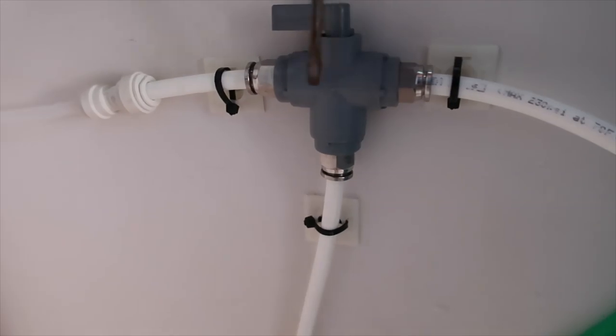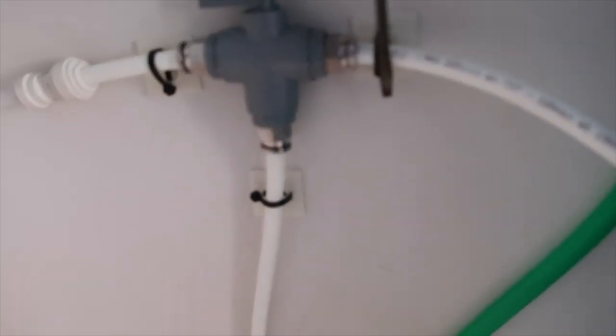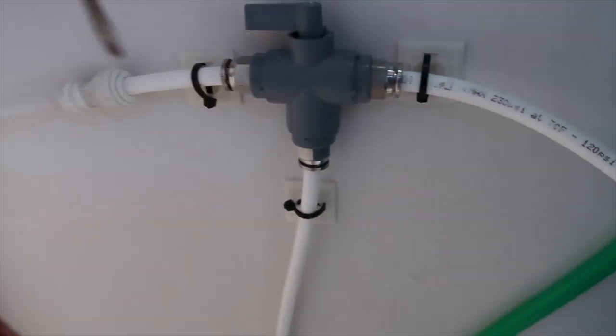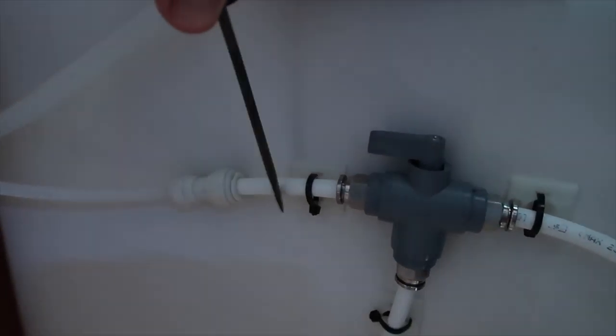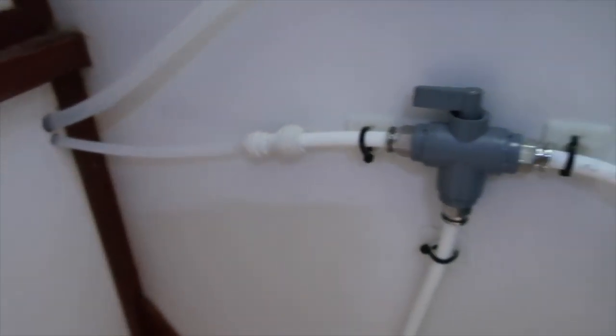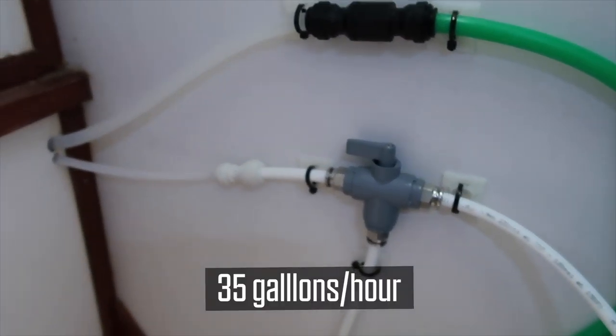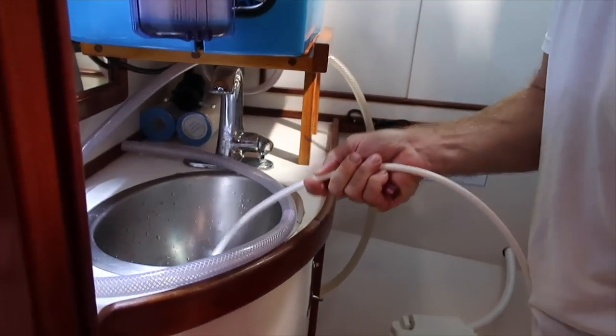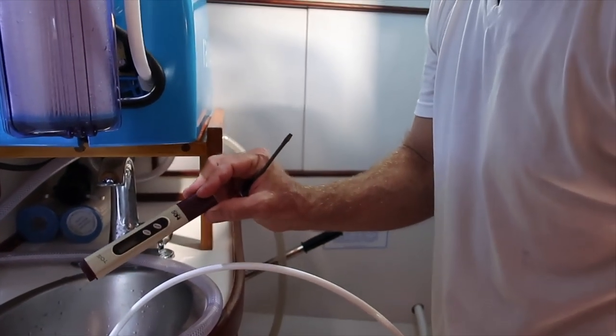The last bit is the product line — it comes off the corner of the case to a Y-valve, which comes in the Rain Man kit. One way goes to an open hose for test water, and the other way goes into the tank. Because I couldn't find parts for the five-sixteenths hose, I had to reduce it down to a quarter-inch hose, but I haven't had any flow issues and it seems to kick out the same amount of product water. When this valve is turned to the test line, I can bring it down to the sink and let it run through until the water is good quality using a TDS meter. When I'm comfortable with the quality, I switch the Y-valve and it goes right into the tank.